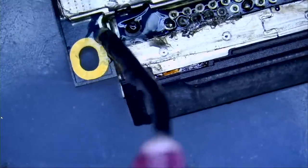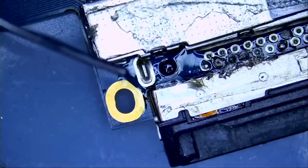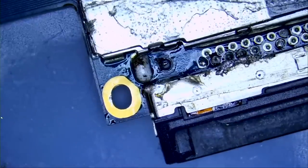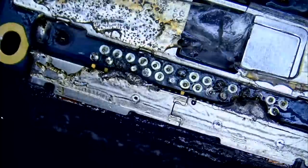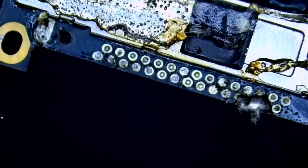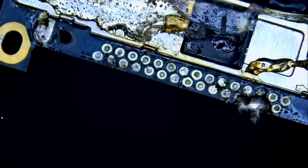The most important pads to apply solder onto are the legs, left and right. We should be able to easily remove the connector or the center pins with just a little bit of hot air. As you can see, the area is very tight and you can barely get the soldering iron in there. Let's apply some hot air — and the connector is out. Whatever melted material you see here is nothing, just overfill or glue.